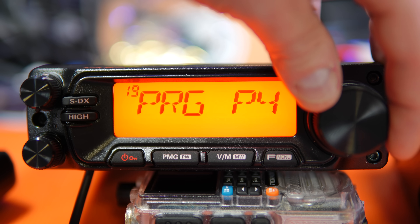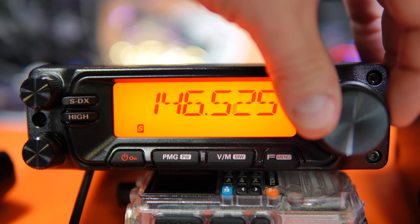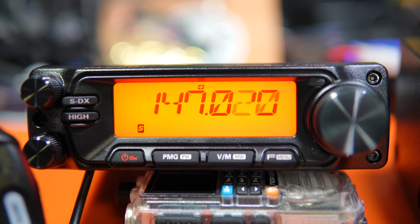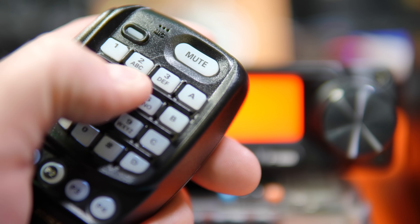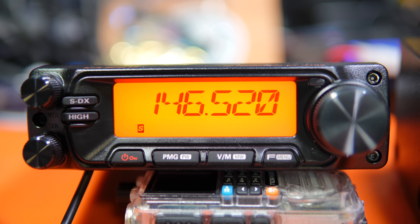You can turn on scanning by holding down the upper or lower frequency buttons. In the deep menu you can go to scan on and hit it, and it'll scan up or down depending on what you selected. To stop scanning just push the PTT button — you can key in a frequency too. This makes it like the first time in months nobody came back to me on a simplex call. I'm very disappointed, particularly because I'm making a video. Southern California, you're supposed to be better at simplex than that!